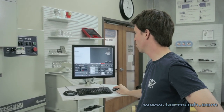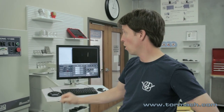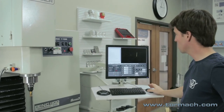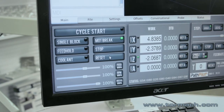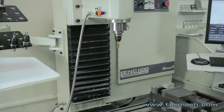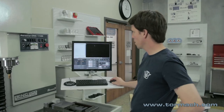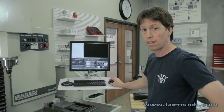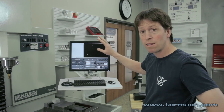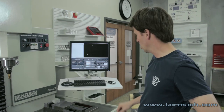Before we begin, we'll assume the machine is off. To power it on, bring up the control software first, then power on the machine tool, twist out the E-stop, and press the green start button. Then I'm going to reference all axes — reference Z, reference Y, reference X. If I zero out all the DROs when sitting in this position, that basically sets no work offset, making work offset zero equal to machine offset zero so we can look at machine coordinates.